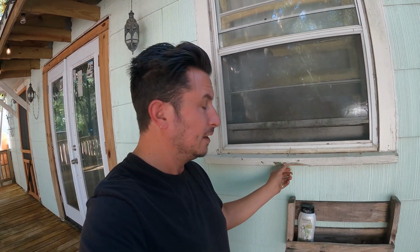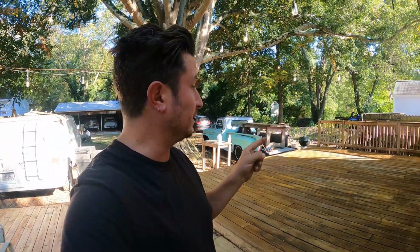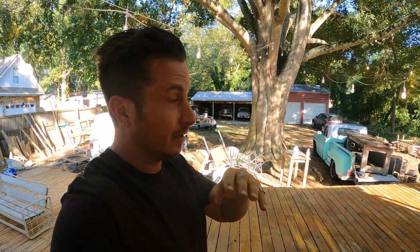Take a look at this for upcoming project land. This is what paint does when it starts to fail. It sits right on top of the wood and then fails by peeling. If you do a deck restore or a deck paint or a totally solid whatever, it's going to sit right on top of your wood. This is actually a pressure treated sill that I built, and this is exactly what would happen even with a high quality surface product on the deck, and probably would not take long in front of the door where we all exit the house and cross the deck. So anyway, that's why I use the oil-based deck stains, because they soak in, and they'll soak in even into the rotten stuff. They won't just sit right on top of it waiting to flake off.